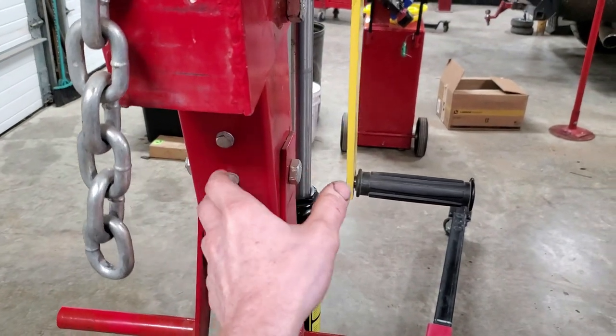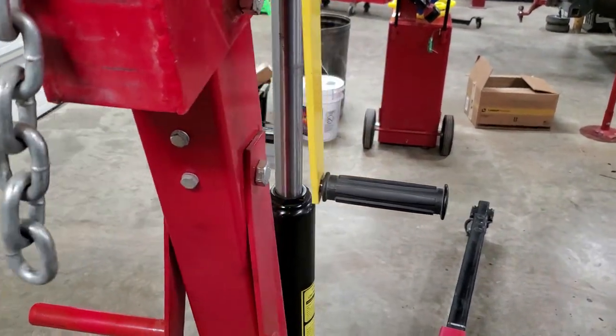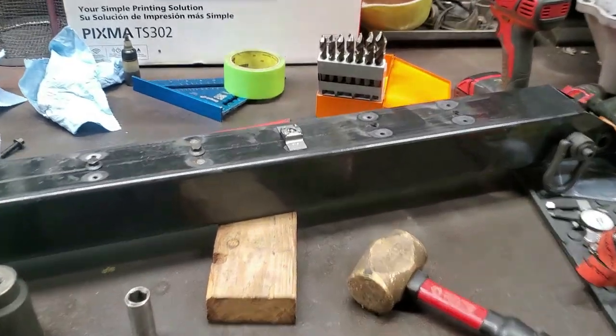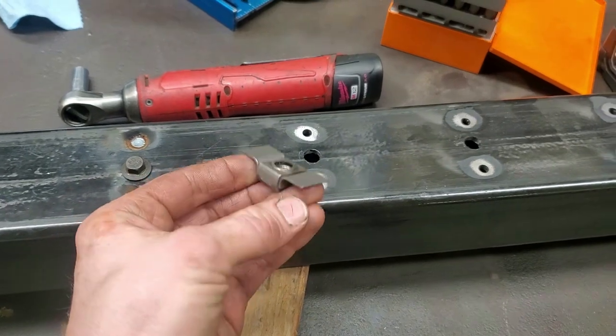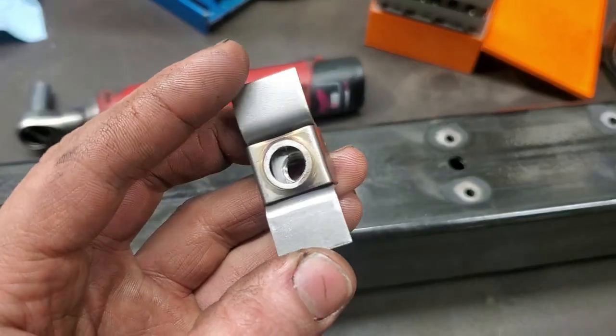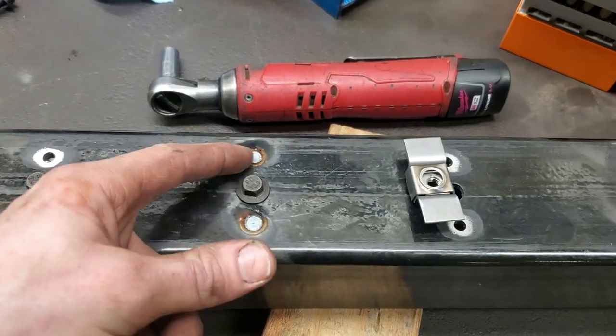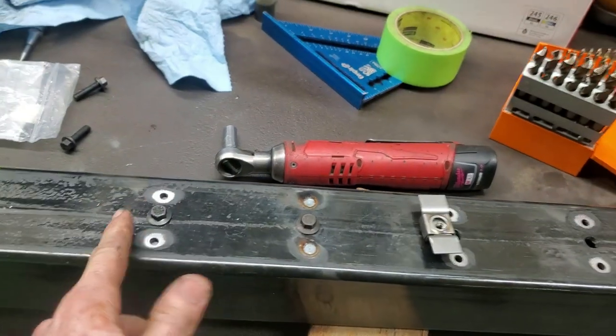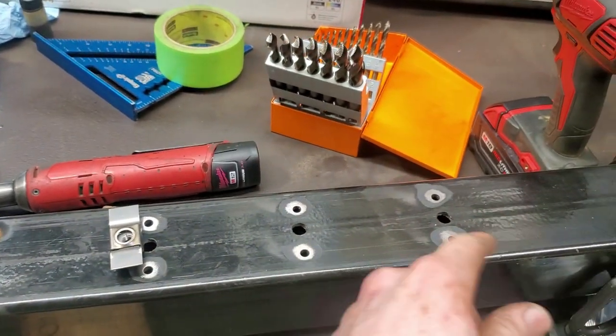I also took the handle — it used to be bolted right here — cut it in half and welded it onto these uprights. I had to do that because otherwise the handle would hit the other handle. But it worked a lot better because it made it wider so you have a little more leverage when turning it. The way the factory had it was so skinny you didn't really have much control. On the bottom of the boom I've drilled several holes and on the inside I'm welding a captured nut to the inside of the boom. Now I can stick an eye bolt in many different locations to be able to tilt the motor with a ratchet strap. If you want to modify one of these engine hoists like I did, I'll be putting all the part numbers for the casters, pulleys, and other parts in the description.